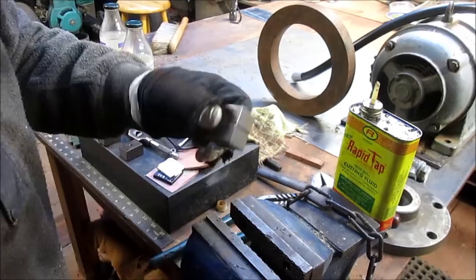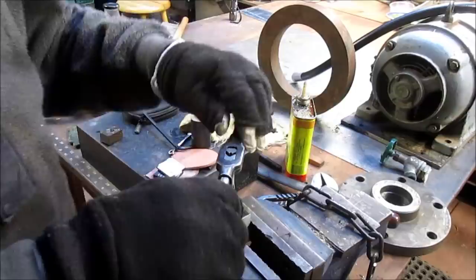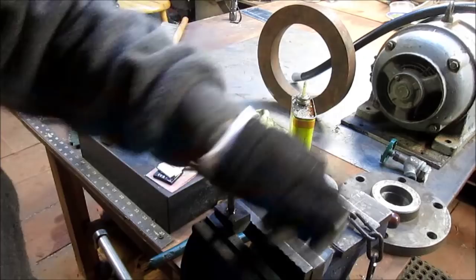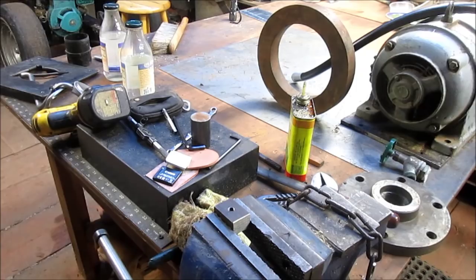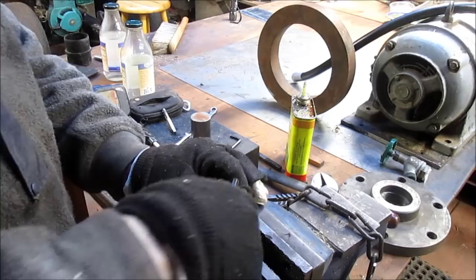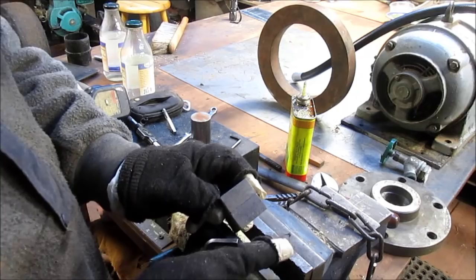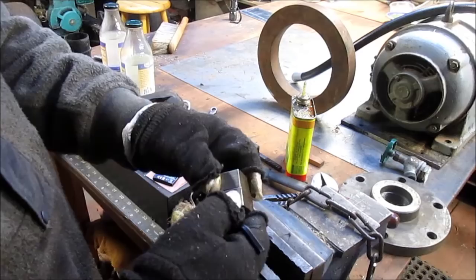And with just a little bit of knocking around, I think this thing could square up. That looks pretty good. So we're going to tighten it up now. And we haven't got an exact perfect surface there. So we're going to put it on the mill and surface that. And then we need to come in and relieve just a little bit of the inside edge.